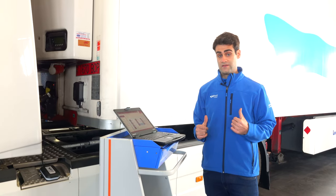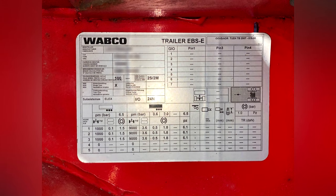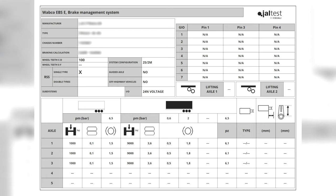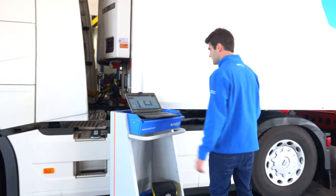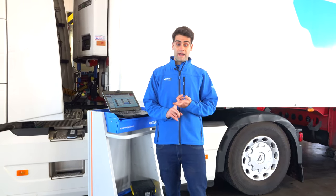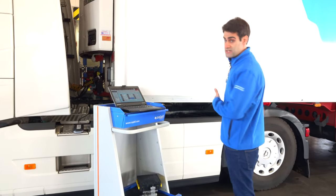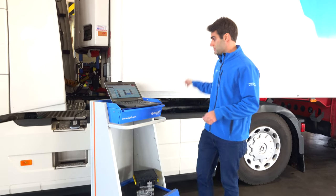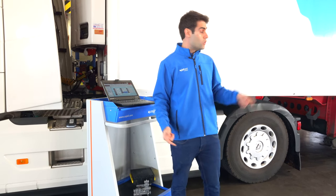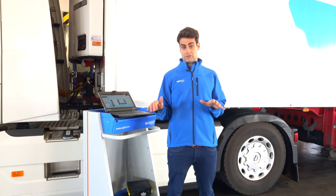Now I have this PDF on my desktop and I'm going to compare it with the plate on the chassis. It's correct — my plate and my parameter file are exactly the same as the one on the chassis. It means that now I have all the information of my modulator for this trailer, and the next step will be to replace the module. Remember, those internal errors are not possible to solve without replacement.